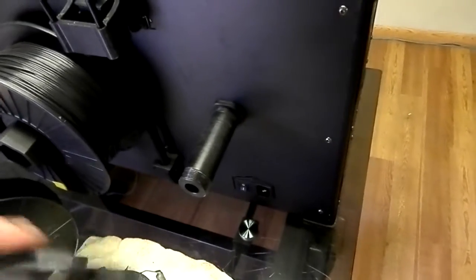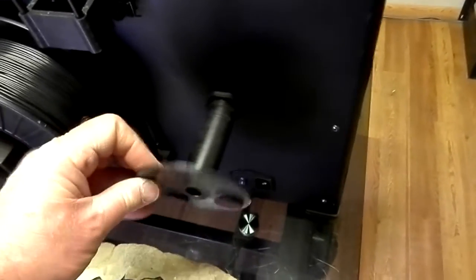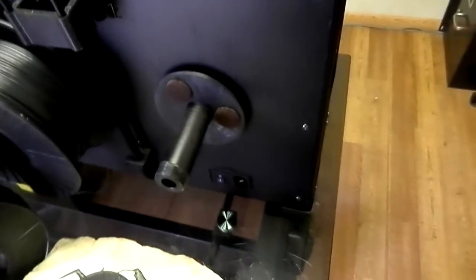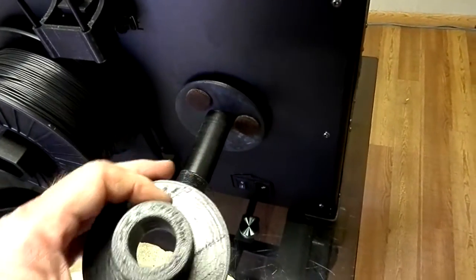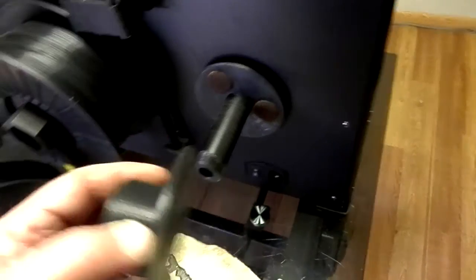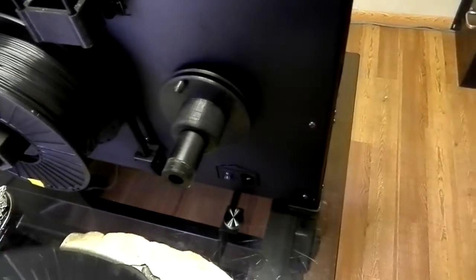I came up with a good idea and it worked great. I made some adapter plates. This is a back plate — it fits right over the nut that's part of the unit. And this is the actual adapter that converts this pipe size into the outside size here, which fits these spools. The little pads you see in there provide friction so you can tighten this nut down a little bit to get the right tension on your filament so it doesn't unspool. It works really well.